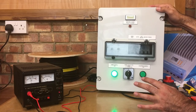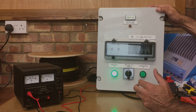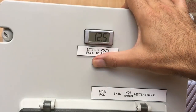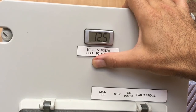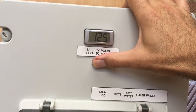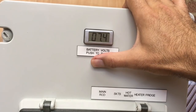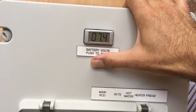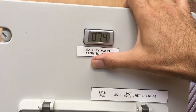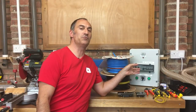Let's zoom in on the meter and change the voltage on the bench supply to check that it's actually working. We can see there it's saying 12.5 volts. Now if I turn the voltage down on the bench supply unit and then press the momentary button again, we can see it's only reading 7.4 volts - obviously a battery would be in serious trouble if reading that for real, but at least that demonstrates the voltage meter is reading correctly.